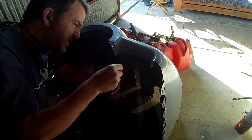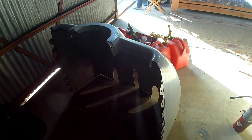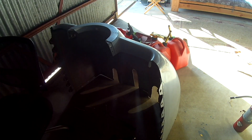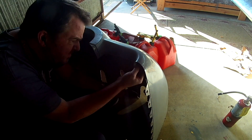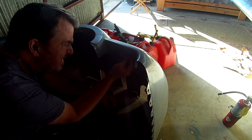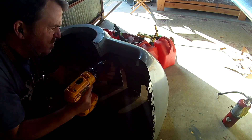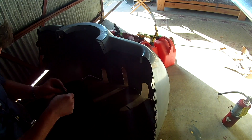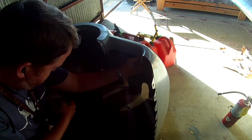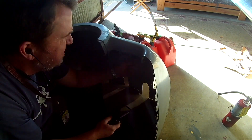So there I am — I've got the holes drilled, and now it's just a matter of countersinking and screwing them in. Sorry for the horrible lighting — the director of photography is fired. One thing that is a little bit of a pain is I've got a bigger drill and that air inlet's not that big. You need to get the countersinking cage in there and that's pretty long. What you really need is a small air drill to get in there. The big drill does technically fit, but it's close. I've got my chamfering tool out to do a little bit of work where the drill just didn't get it quite right.